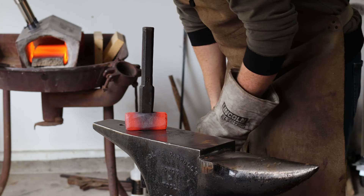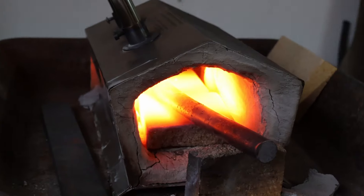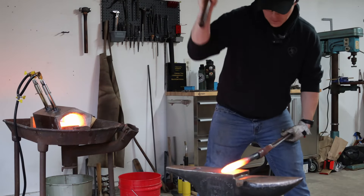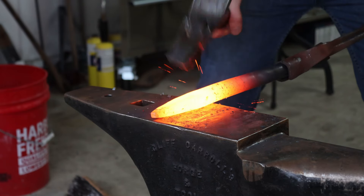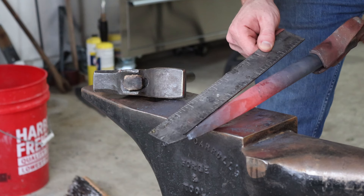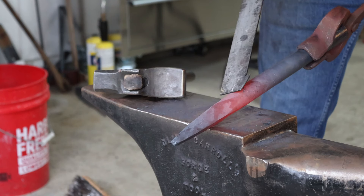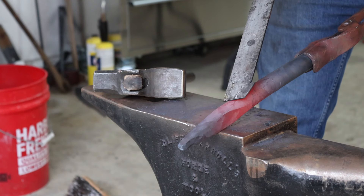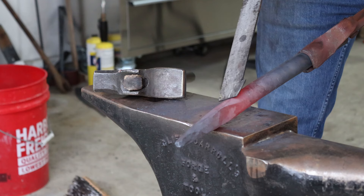The drift gives you the opportunity to form the eye of the tool to the size and shape that you want without losing a whole lot of extra mass beyond what you've already punched out of the piece. I think that's gotten long enough and skinny enough for the initial pass. I've got about a four inch taper here, and I'm going to incorporate some of this non-tapered steel into the remainder of the drift as we transition up through the taper and into the handle.